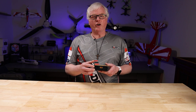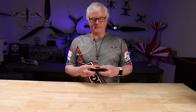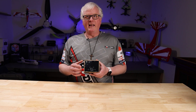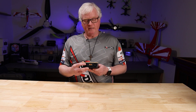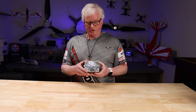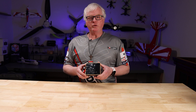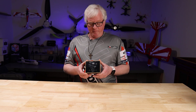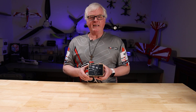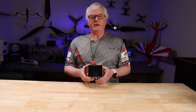The inputs are an XT90 and the outputs are XT60s. The DX6 Duo has a color IPS screen and a Type-C USB port on the back. Despite its small size and affordable price, the DX6 Duo is a full-featured charger that supports multiple chemistries, most of the common ones on today's market. Its improved software interface makes it easier to record battery data and update the firmware, giving users the versatility and performance you have come to expect in an iCharger.